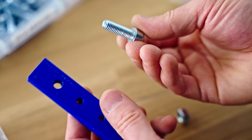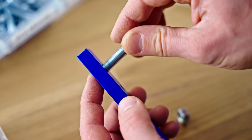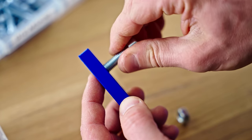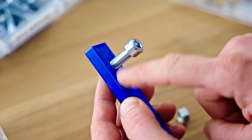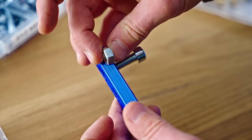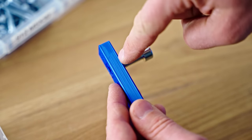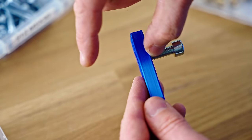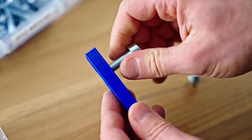Now, once you go to dissimilar materials and you still use your steel bolt that is going to be extremely strong and you thread it into plastic, well, all of a sudden, there is one failure point. That failure point is the plastic. And there are a couple ways to mitigate this. So either, you know, you increase the engagement. So instead of just doing the 6.8 millimeters here, you could do like 68 millimeters tall engagement. That's not always realistic.